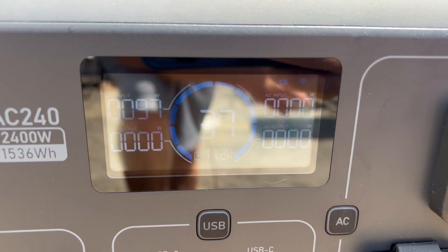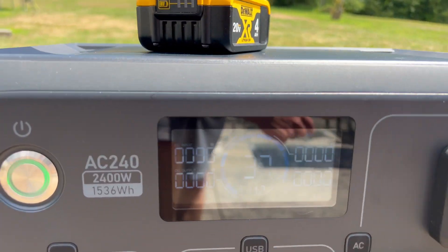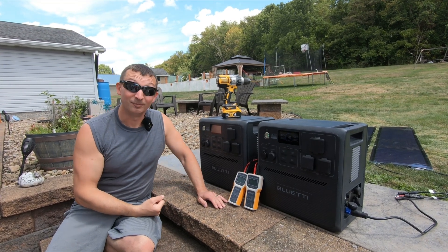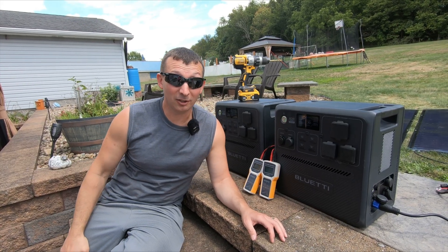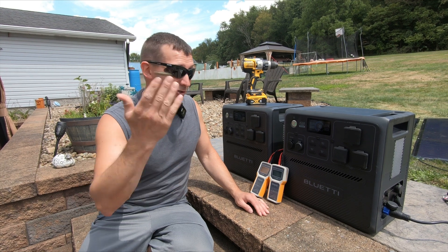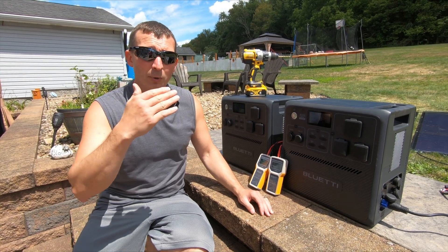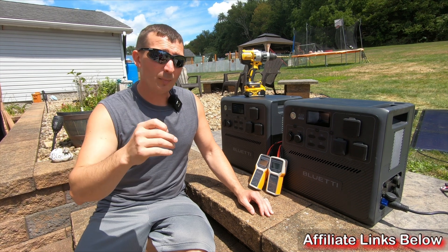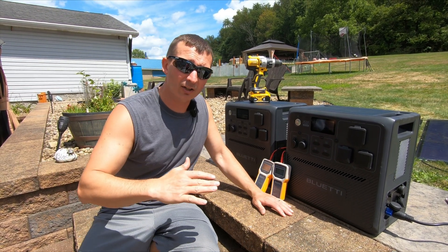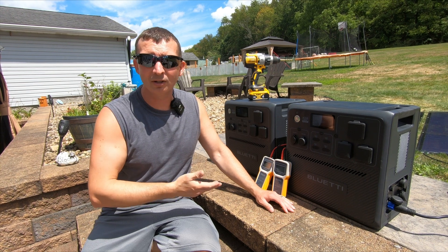With the sun back out, there's only about a four to five watt difference — I was getting about 97 watts on the drilled one and 101 to 102 on the other. In the beginning there was already a two watt difference, so really there's only about a three watt difference with two holes drilled in the solar panel. Even in cloud cover it was only a two watt difference, which is what it started with anyway. These panels are good for putting on top of an RV or camper — available with holes for screws or with a sticky back.